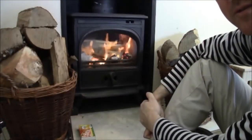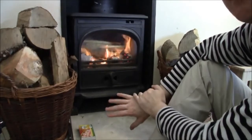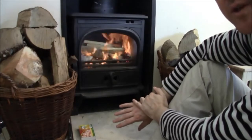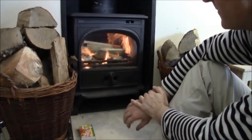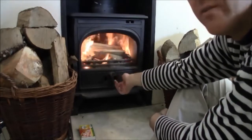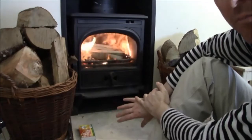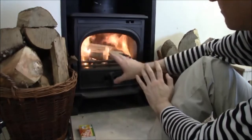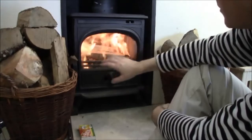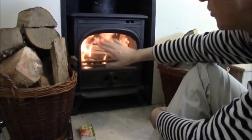Play the match around the paper at the front. A good long match will last a long time, so light as many pieces of paper as you can, then throw it in there and close the door. At this moment we have plenty of airflow through all of these vents. Now, after about a minute it will be much like this. Each stove behaves differently, but once the stove is adequately burning and at temperature, you can start to close down the vents. The reason is you don't want too much air in there, otherwise all your fuel will burn very, very quickly. At this moment I want it to get nice and hot — I want to see a good flame, almost a blast furnace-like effect to make sure everything's pretty hot.